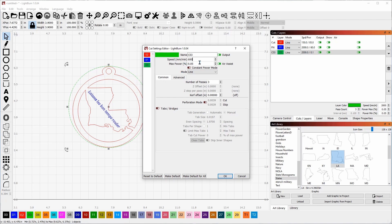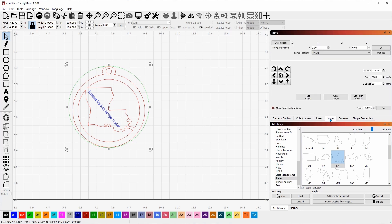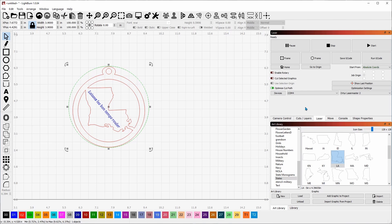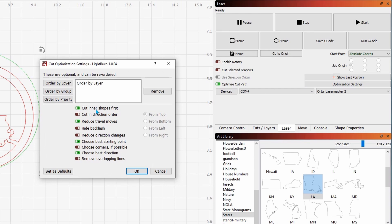I set the speed to 2000 and max power to 0.05, leaving it in line mode. That barely turns on the laser — 0.05 won't cut anything, but it'll output the laser so we can see how it moves. We're going to put this on three passes, which gives us plenty of time to get it perfectly framed. Let's take the speed down to 600 so it goes nice and slow. I'll also turn off the air assist since I'm using a diode laser that doesn't have air assist connected to the pinout on the control board.